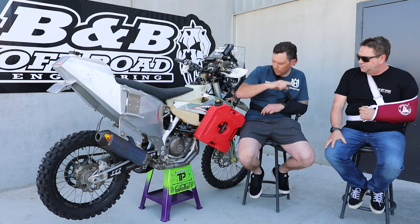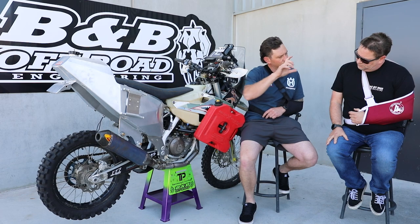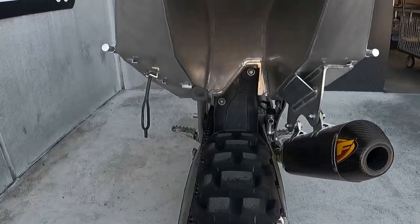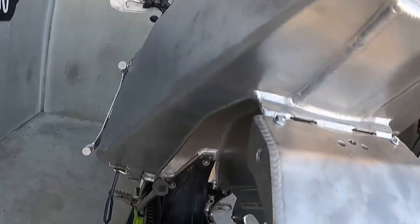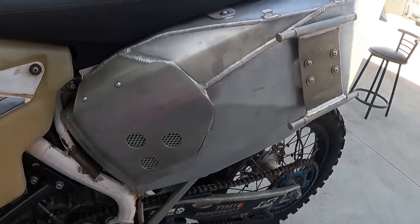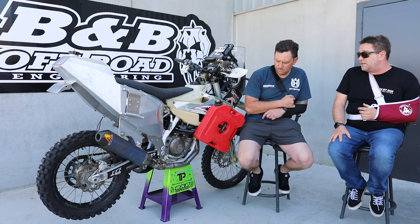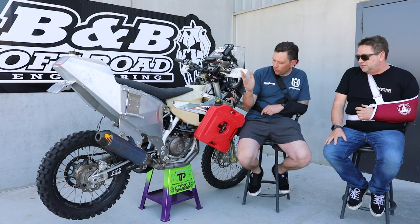Because the last time I was here a couple of weeks ago, you were cutting out a little bit more for the rear shock — you didn't take into account the movement of the shock once you load the bike up. Yeah, I knew it was going to be touch and go there, and by the time you add a little bit of thicker material it grows a little bit than what you had in mind. Just to be sure with the amount of rock on the shock bottle, I didn't want it rubbing a hole. It was only about three or four mil and it was a pretty quick fix. You couldn't even tell now — it all looks buttoned up.